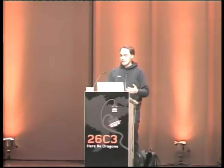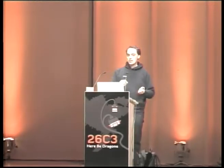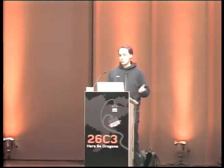And you should definitely try what happens, especially to sensing fuses. And I have seen some part failing at sensing fuses if you apply voltages in the wrong order. It would sense all fuses as being 0. And this is the default state after production, so it's the most insecure state. So if you want to re-enable Jtag on a device where the Jtag, it is not really a fuse there, but some flash thing, you would have to set up a wrong power sequencing, and it will come up all in insecure mode, and you could use Jtag again.